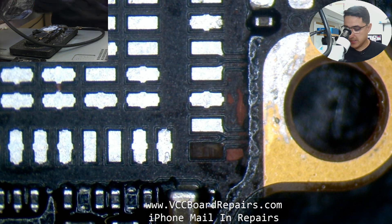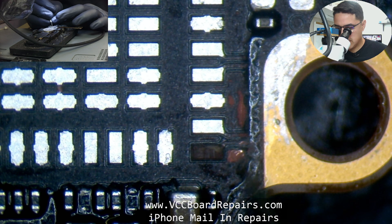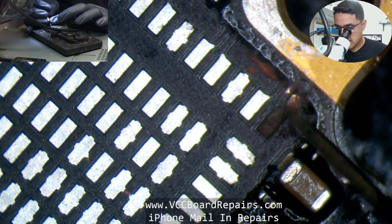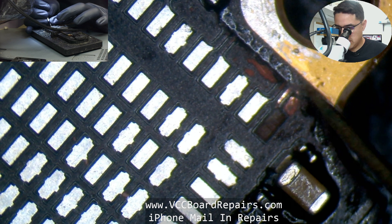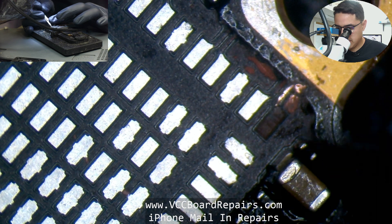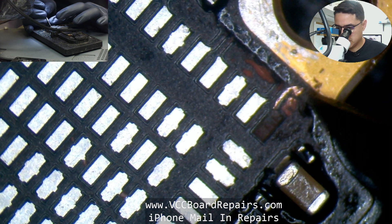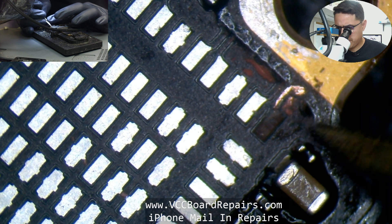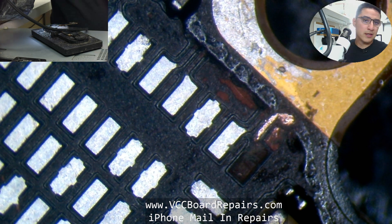This is an iPhone 8 Plus that has a broken WiFi pad, and we're going to use one of the soldering lugs to recreate this pad and fix this board. The first step is to scratch out the trace so we can reconnect the broken connection. The pad connects to the chip and continues through the trace through the rest of the board, so we first have to expose this part of the trace so we can solder onto it. Be careful not to scratch out the ground layer next to it. I'm using a blade here to scratch it out — make sure your blade is very sharp.